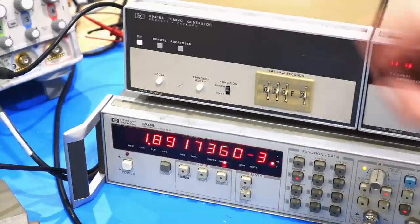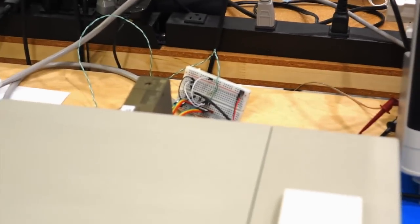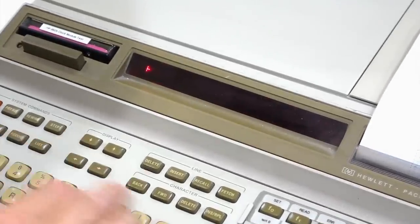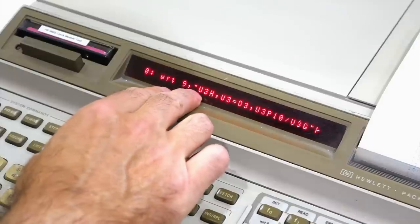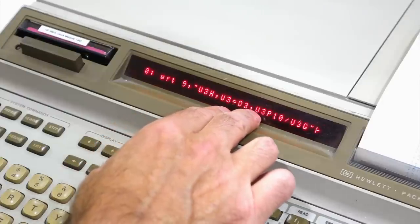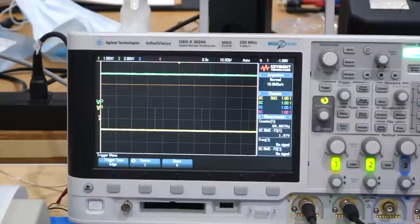Now we're going to try to do the same thing with my little interface. Back there I have taken one of the output lines and brought it to the scope on the green trace. Right now I only have the older instrument on the yellow trace. I've loaded a program — it's a one-liner. This time I use unit 3, set it on output line 3 (there are four to choose from), and generate a 10 millisecond pulse train. One, two, three — hit run. There you go! And you see the pulses.